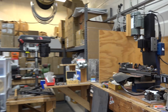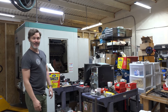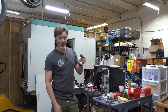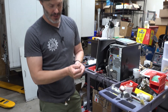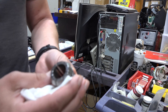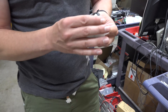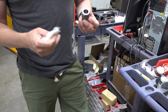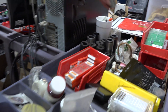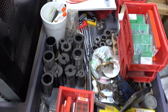As you can see it's pretty wrecked in the shop right now — we've got just everything everywhere. A bunch of my old tools from the old lathe here. I still have a whole bunch of ER32 collets, so that's really nice. I'll be able to use those along with the ER16s that the drill-and-tap machine uses. I'll be getting some Pioneer collets for those — instead of having half a thou run-out we're going to have a tenth or two tenths of a thou run-out, and that's just going to make our tool life much much better. All of these are high-precision collets, and I just need to switch those ER16s out as well.